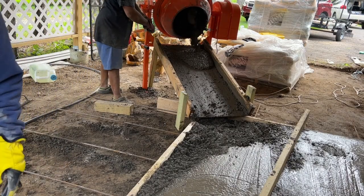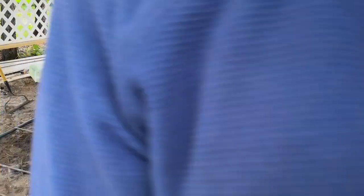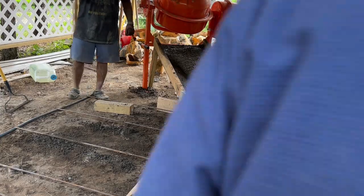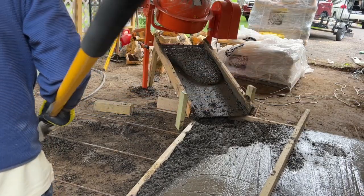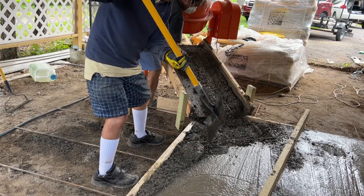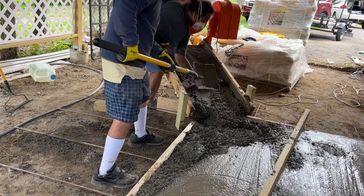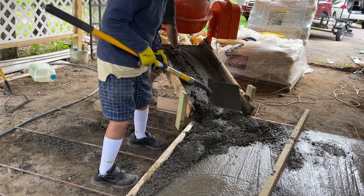Here is the chute in action. As you can tell, the concrete was flying all over the place, but it landed all within the chute — so less waste. That's my dad helping me. Once the concrete is on the chute, we just spread it down onto the form. The chute was easy to move around. The only thing that was hard was moving the mixer as well, because of the rebar sticking out from the sides, but it definitely made the work a lot easier.